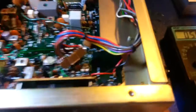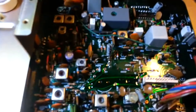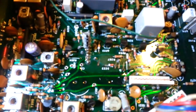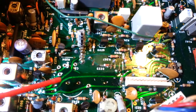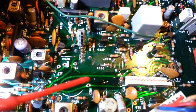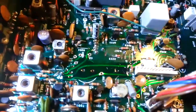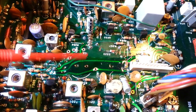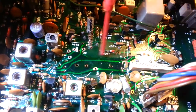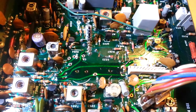Got the bad electrolytic capacitor here which we'll get to in a second. Got lucky on this one — actually no actual damage other than some corrosion on the board, so I was able to just remove the capacitor and the surrounding components, clean off all the traces. Put a lot of flux on here — I mix up my liquid flux, saturate the area on both sides, tin all the traces, then put a good epoxy overcoat on there. That's all cured now.